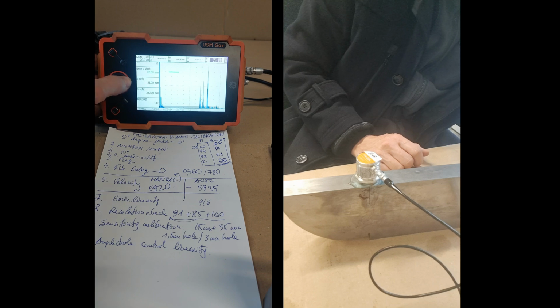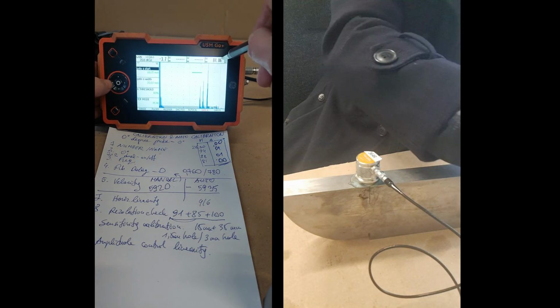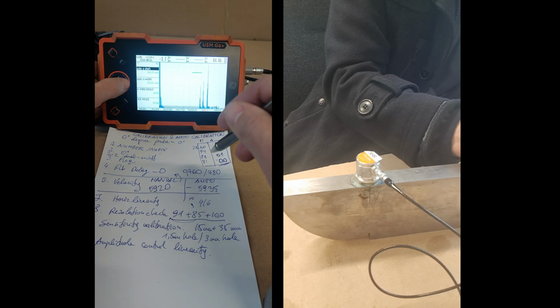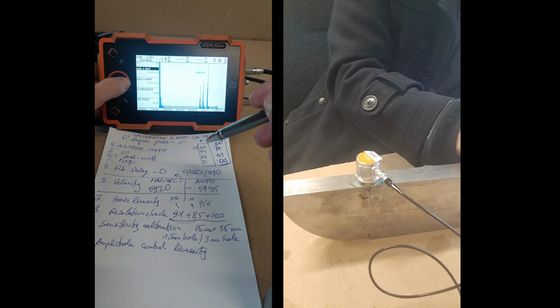So moving with the gate right, now back here, right, now too much back. I need to take the first one, and it should be 85. Okay, that's point something. Okay, point 15. So 85 is 0.15. The next one should be 91. Let's check. Okay, 06 for this one, 0.06. That's the 100th of the millimeter.